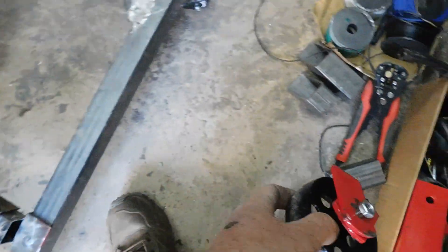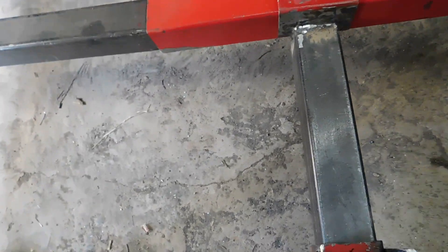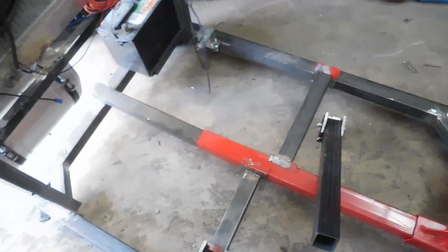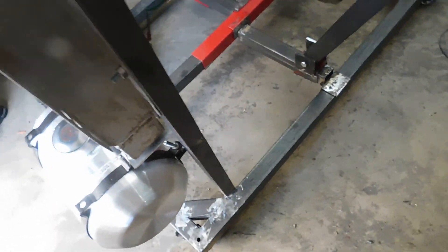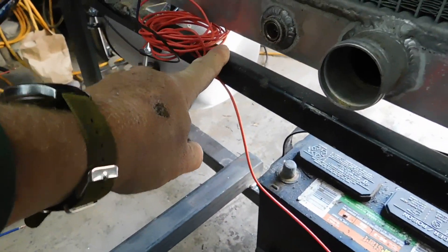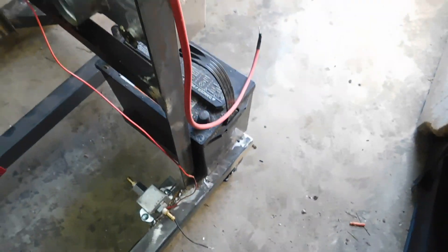This tube here, like I said, is inch and three-quarters with relief cuts on the inside, pushed in and welded at the end. I made brackets that go around the front — a vertical bracket for the radiator on each side, a little cross brace across the radiator, a bracket for the electric fuel pump, and a battery bracket.